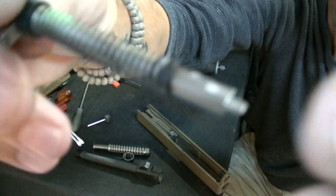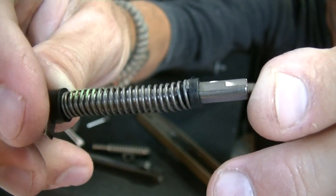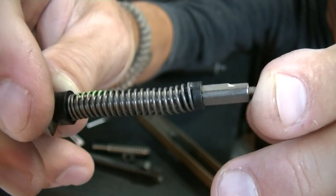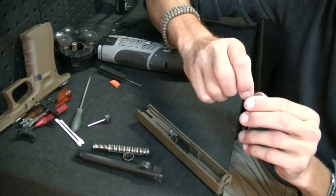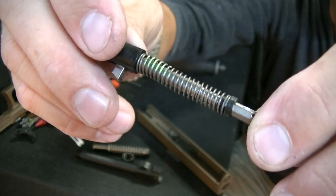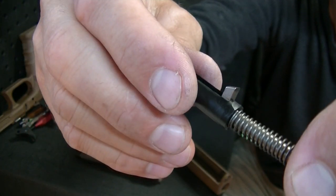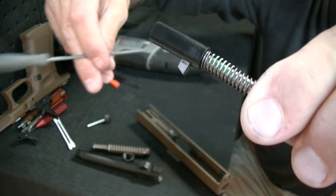We don't want it to look like this — see how it's offsetting the two cups? The end of that spring is right where the cups separate, where the two cups meet. That is going to cause a big headache in a lot of different ways. You'd be scratching your head wondering why your gun's doing such weird stuff, and it can often come from something like this. Make sure these are seated right and the end of the spring is not sitting where those two cups come together. On the side here, you can see there's a little wear mark — some videos say to address that immediately, but that's not a good idea; you'd have a striker that rattles.